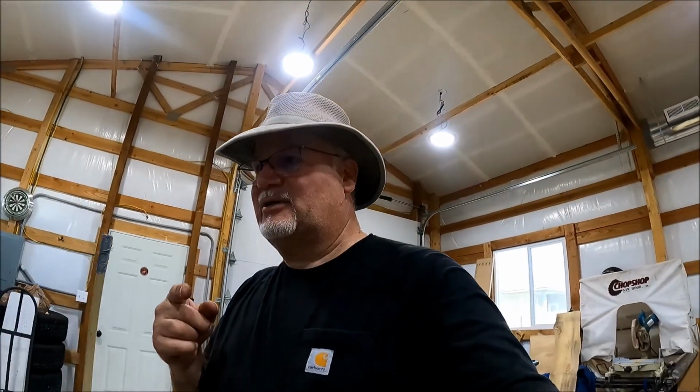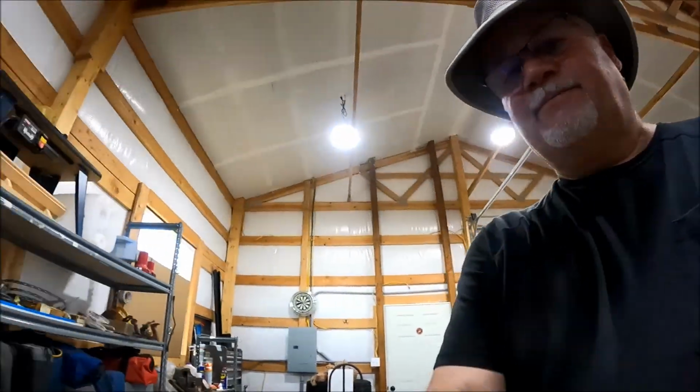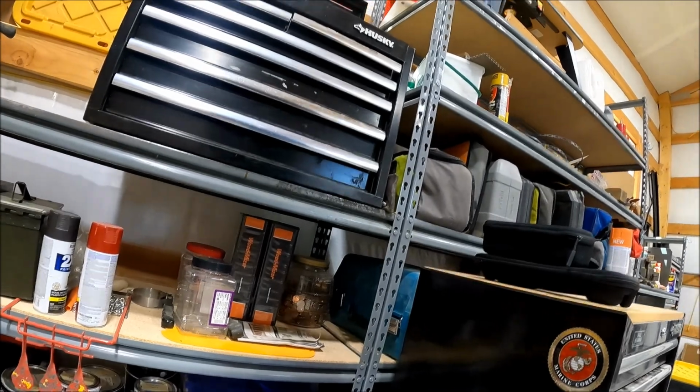So that's maintenance on the mill. I'm doing it a bit slow, just trying to show you a little as I go, but it's something you do over and over and constantly keep up. You need that mill well lubricated, otherwise things are going to break, and you keep the books with you. Mine are sitting right underneath this toolbox. I take those with me on the job site. When I'm not on the job site, they go on the shelf.